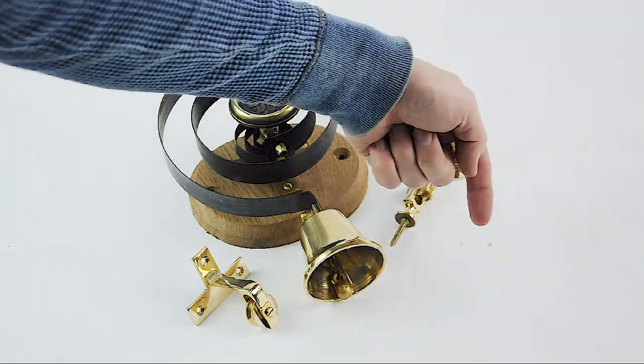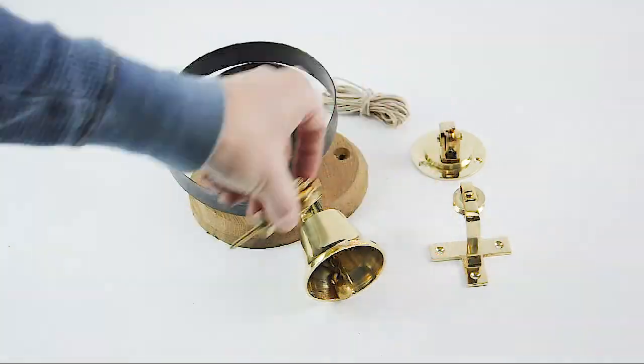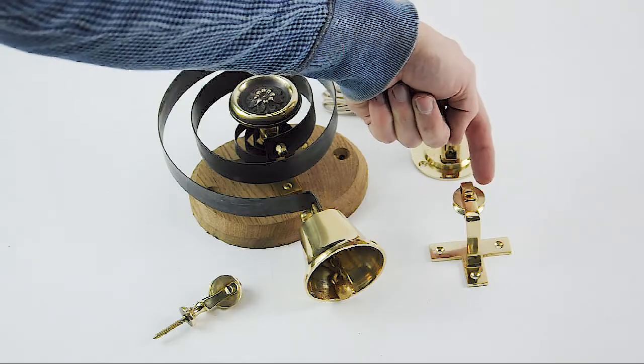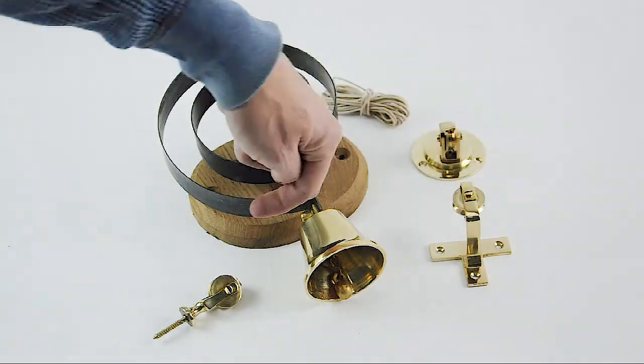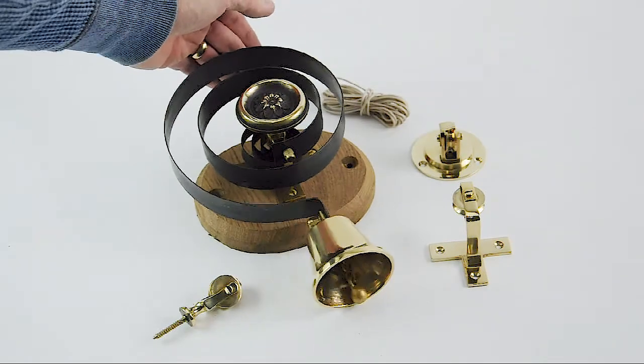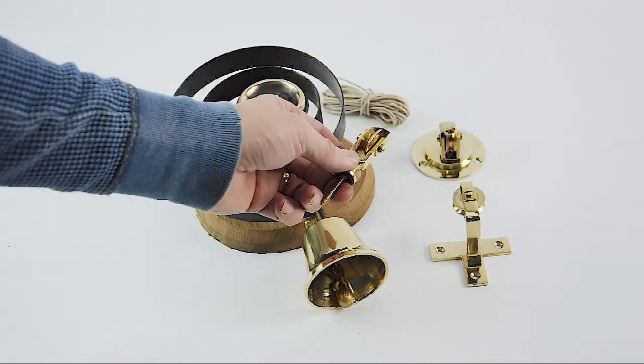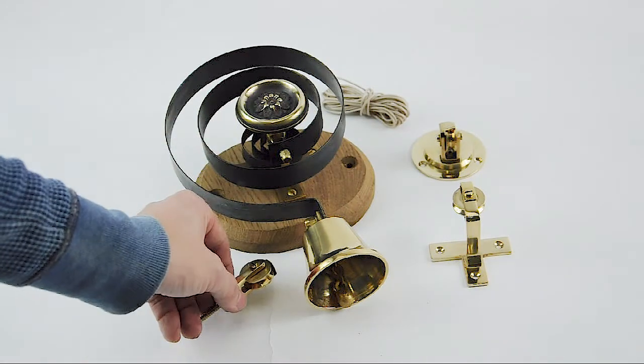The blanking pulley will be on your wall — the cord comes through it and then goes over the pulley where it meets the directional pulley. The cord comes out of here, around there, meets the directional pulley which allows it to do a 90-degree turn, where it meets the arm on the back of the bell itself to make it ring. The extension pulley is just used to guide the cord along the wall in case you've got a long run.